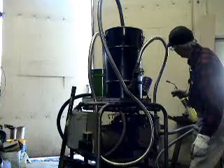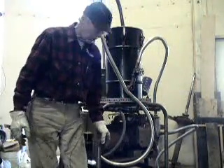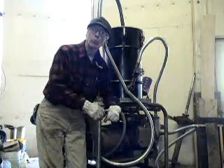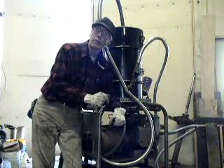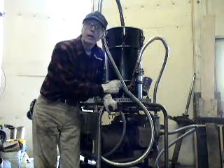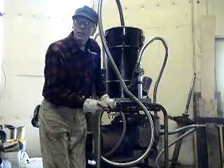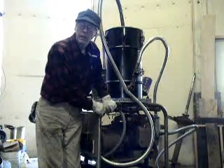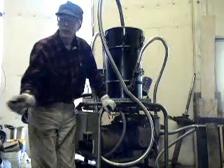Once it evacuates and the gas is rich enough to burn, we'll be able to start the engine and get the generator running. Charcoal gas is not as powerful as wood gas, because in the process of making charcoal you've removed most of the hydrogen from the wood. The advantage of charcoal is you don't have to worry about engine tars from the wood getting in and gumming it up. I do have to worry about dust, but dust is much easier to filter than tar.